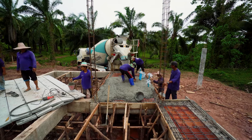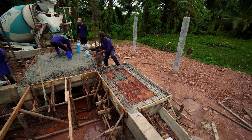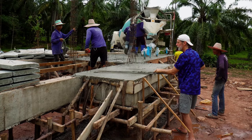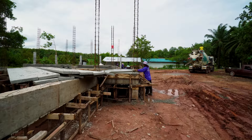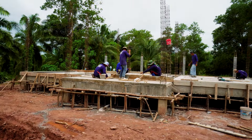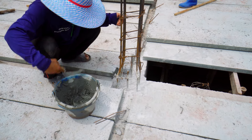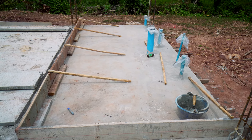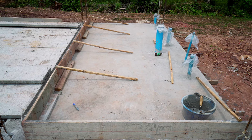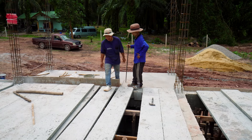I think you're going to end up bucketing the concrete to the back porch pad right here. They got a guy going around sealing any of the holes up. So that's going to be the bathroom — they poured that first because of the difference in elevations. The bathroom floor is lower than the actual finished floor in the house. Same with the back porch and the front porch — they're all lower than the finished floor inside the house.